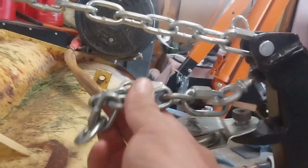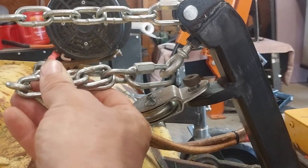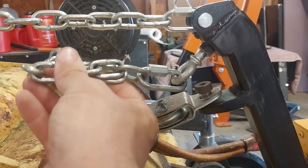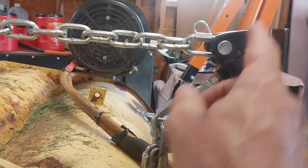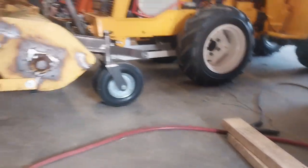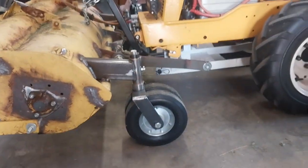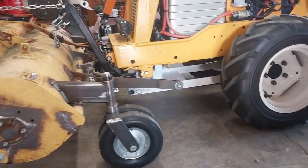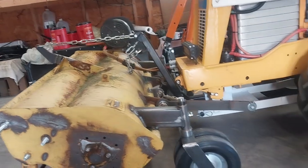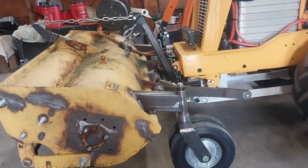Also, at the end of the last video, I had broken this little doobie whopper — it had just sort of gone up there and you can see this crazy angle that it's at. It wasn't as bad when I didn't have the inch-tall spacers in there, but it was still pretty bad and it was pulling it sideways, and that's no good. So I made that little dude. Here's the problem though: now that I have those one-inch spacers on it, I still have the same problem as before — the rear pivot and that front pivot are kind of on a pretty close straight line, and that top pivot is out ahead of the lower pivots.